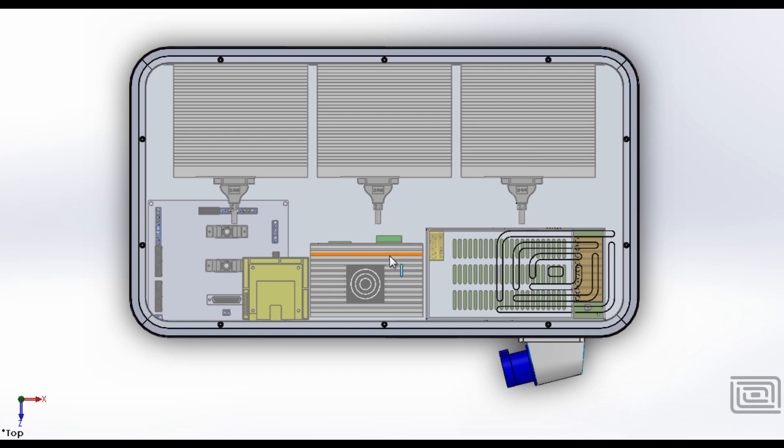I've got a closed-loop stepper motor which controls my z-axis and a 48 volt power supply to go with that. I've also got a UCNC motion control board which basically generates all the signals for the relevant drives, and then I've got a custom-made breakout board which I might do a video on, because I'm going to change it to a more advanced breakout board with optocouplers and differential line drivers. The idea is it's going to be plug-and-play with the UCNC board so it can interface with the servo motors, stepper drivers, etc.